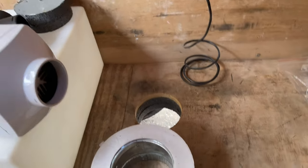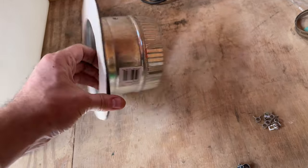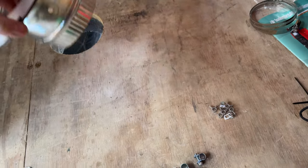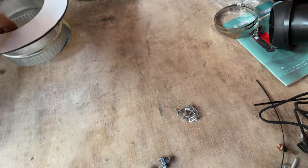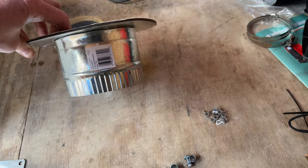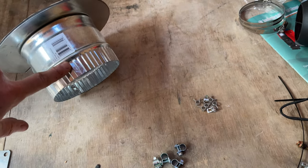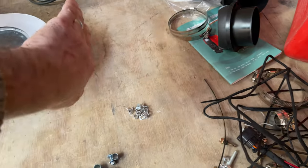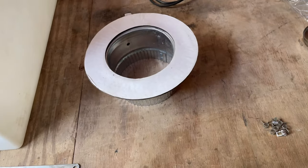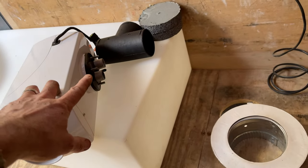So I'm following what that expert mentioned — using a five-inch furnace takeoff, which has a little gasket you peel and stick to your furnace and screw in. This acts as a heat shield down in the hole. Whatever sticks out the bottom I'll notch for whichever way the pipes go — intake and exhaust — so at the front it'll have a little heat shield for mud so it doesn't get into all the fittings.